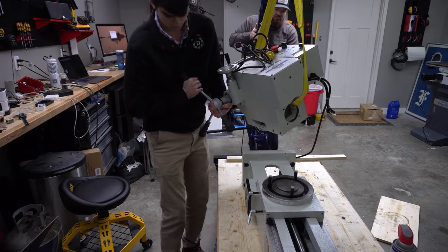Continuing with the theme of safety, an electrical cabinet such as this one is a necessity to keep coolant, debris, and fingers away from the electrical components. To get wires from outside to inside the box, you could drill one large hole, fit it with a rubber grommet, and then stuff all the wires through that hole. However, a better method is to use panel mount connectors. Panel mounts exist for all types of electrical connections, including barrel jacks and the popular Ethernet RJ45 connection.